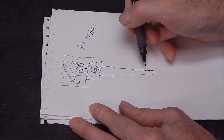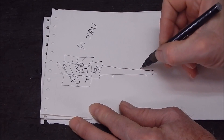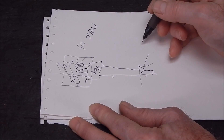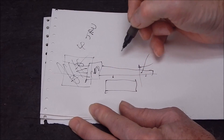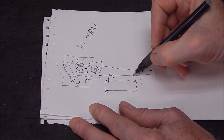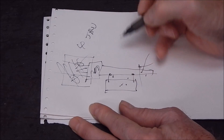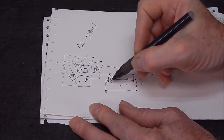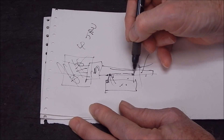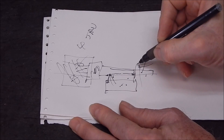Once you've got this aligned correctly, you measure how much length you want and chop it off - get rid of the bit you don't want. You're now going to use the top slide. You read off the taper, move it up and down - when the readings are constant as you move it, you lock your top slide at that angle and you're good to start cutting. Put a cutter in and basically machine it back, reduce it down until you're getting close to that end diameter that's off the chart or off your measurement.